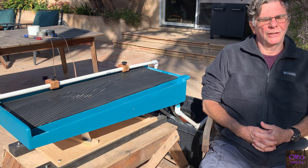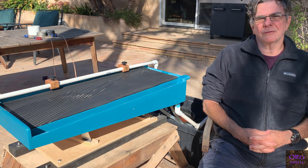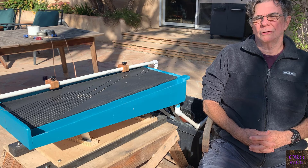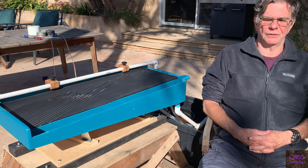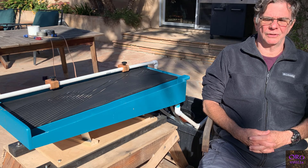I hope you enjoyed the video. The results are very encouraging — we got about 80% recovery round-trip through all of that processing with very heavy and difficult black sands, and about 10% ended up in the number two port, which I'm completely happy with given the material. If you enjoyed the video, please subscribe and I'll make more. We'll have fun with machines and desert prospecting. Thanks a bunch for watching.